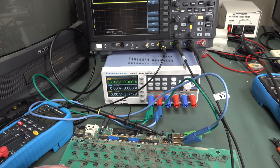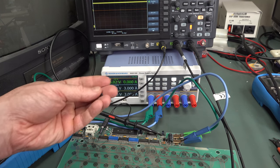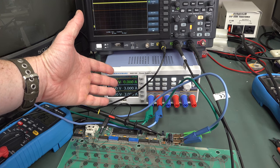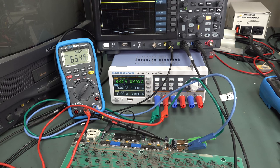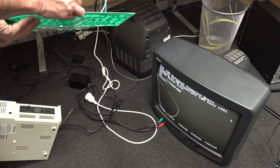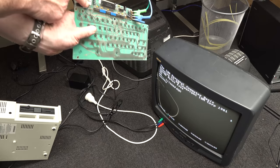Now we're transmitting. I could go into the intricacies of how or why — this cap seems to measure okay and I don't think its leakage is an issue. But the reset line is still low, and when we touch a key it wakes up. Sometimes I can get it to latch on — there we go, 5.7 volts, so it's high. Then it goes low again. Brown, black, green — you know what that is — a high-value resistor. And look, those two pins are shorted where I've removed the cap from. If I measure that resistor: 170k? What? Well, I thought maybe the 1 meg carbon film resistor had failed, but it hasn't. Have I missed a trace on the PCB?